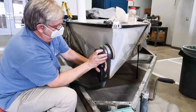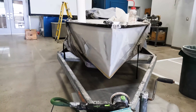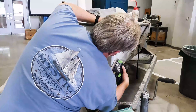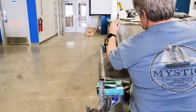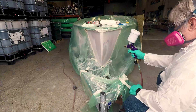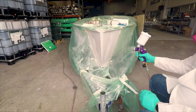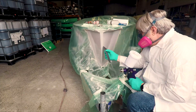After the final fairing sand, I add two coats of unthickened epoxy with gray pigment to help blend it in, and sand that out for gel coat. Then once it's sanded and shaped up nicely, we tape it out for gel coat and spray the gel coat on. We work with gel coat over the patched area, let that tack up, then keep adding coats and blending it in further with a blending agent.